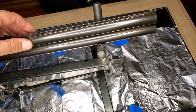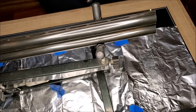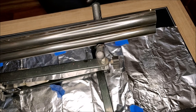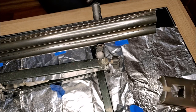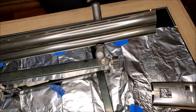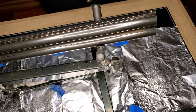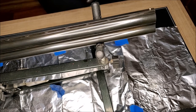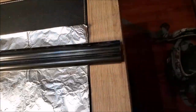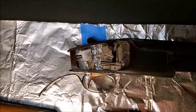This is six coats of Oxpho Blue, carefully buffed out with 4-0 steel wool between coats, and the metal slightly heated up before applying the bluing. You can also see the receiver right here — this was almost completely bare metal when I started, and that's starting to look pretty good. So I think I'm going to go for maybe two more coats, do eight total, and get this to a really dark, natural-looking finish. The bluing's done and that turned out wonderful. Got the internals all cleaned up and put back together, and got the trigger smoothed out on it.